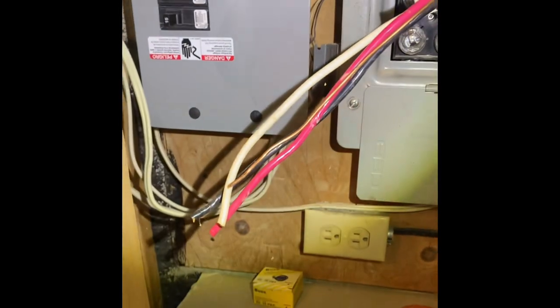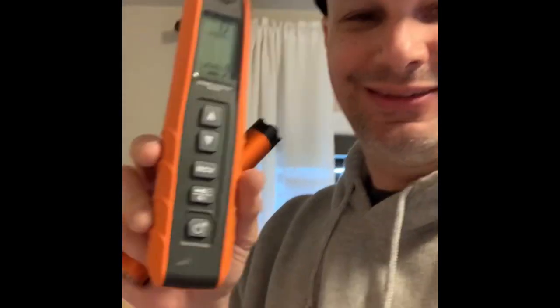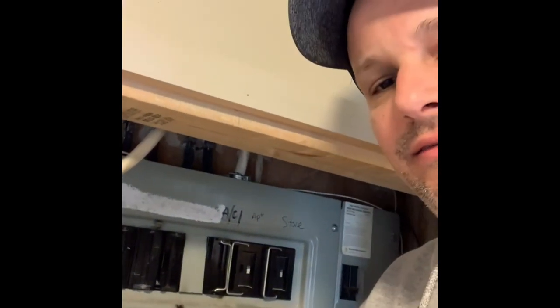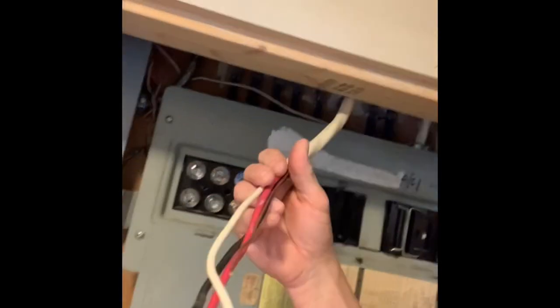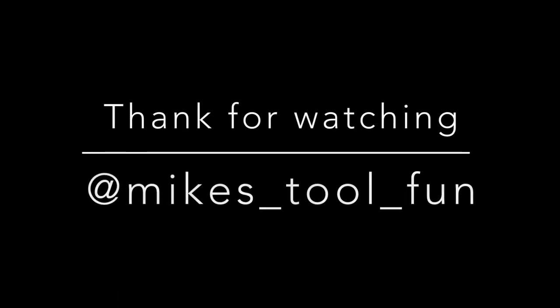This is insane. The ET450 did it again, obviously going through the ceiling. I lost it a couple of times — I think that's because I was trying to film the video and not keeping a straight line tracing the ceiling. Clearly it's a sketchy situation where the wire was buried up top. At least we found the wire, so we don't need to pull a whole new one to the panel. I'll have to see how this is fed and whether I can put a 2-pole 40 in it, but it looks like I may not be able to. We'll see what we can do to fix this.